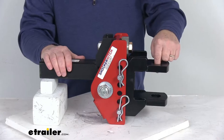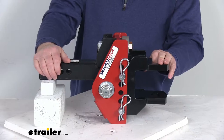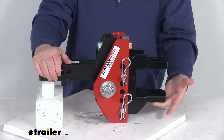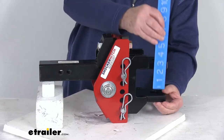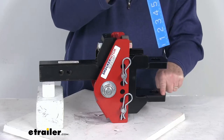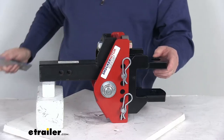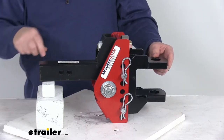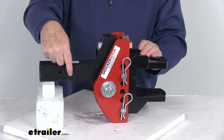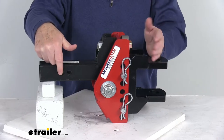The clevis pin drops through there to hold your attachment in place — the clevis pin is not included and is sold separately. The overall height of the two tangs from bottom to top is four and three quarter inches. The inside height from top tang to bottom is three and a quarter inches. The measurement from the center of the hitch pin holes to the center of the clevis pin hole is 11 inches using the front hole, or 12 inches using the rearmost hole.